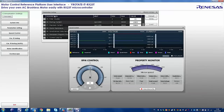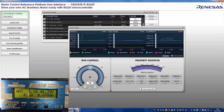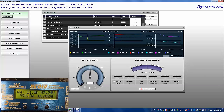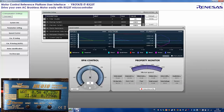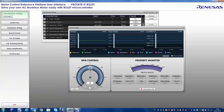Finally, we apply the highest speed and highest load on the motor and check the power consumed. We can reach up to 20 ampere and deliver up to 1 kilowatt on this motor. We do this briefly — reaching 700 RPM then stopping the motor quickly to avoid any thermal issues.